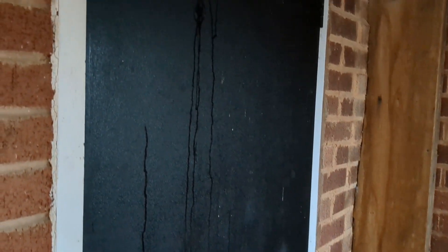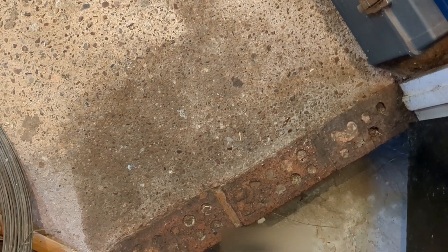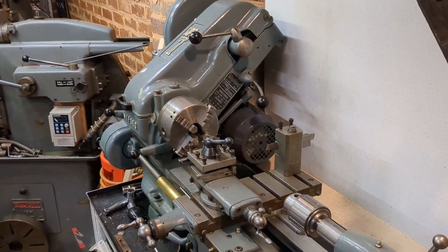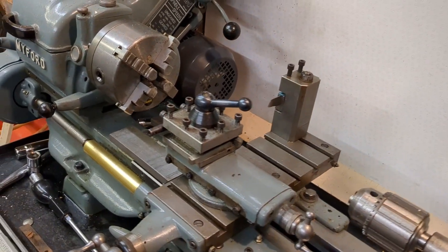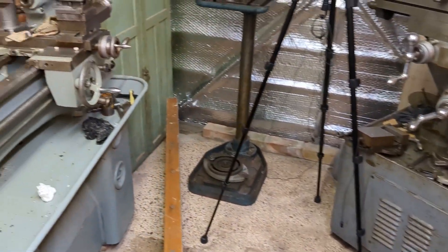This is the rear door, which is uninsulated, and you can see condensation on the outside of the workshop because the inside is cool. You can also see the floor adjacent to the door — that's not damp coming up through the floor, that's actually condensation. Warm air is coming in from outside and condensing on the cold floor. Now, these conditions are ideal for testing whether the improved insulation and reduced ventilation has helped with flash rusting. And without any additional rust protection on the machinery — I haven't got around to that yet — there's no flash rusting. I'm really pleased about that.